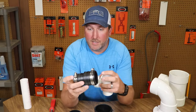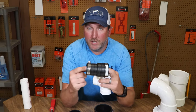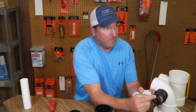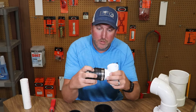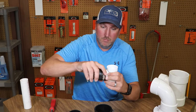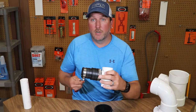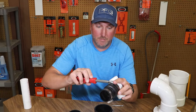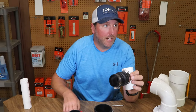What this does — it's a coupling, inch and a half socket by inch and a half PVC pipe. So it's a little bit bigger on one side. What you can do is actually slide this over the hub, line that up, and then tighten this up with your nut driver just like you would a normal Fernco boot or something like that, and now you've got a secure connection.